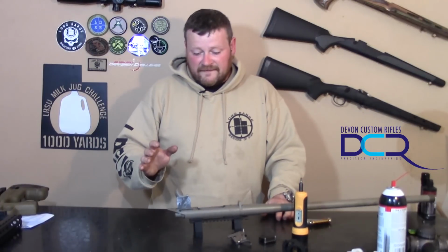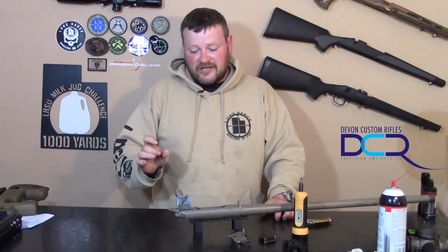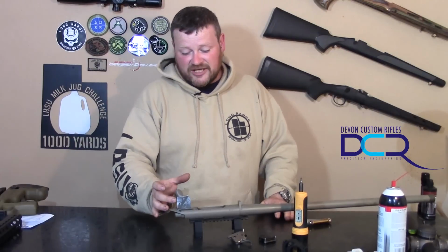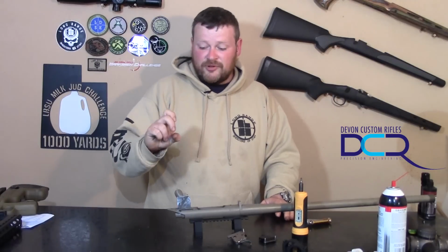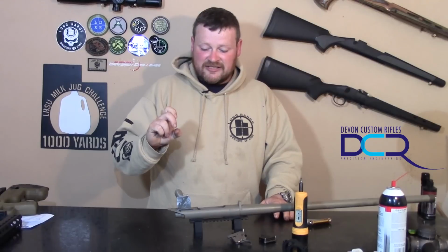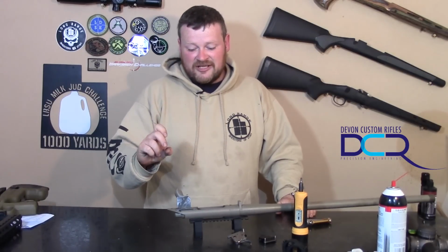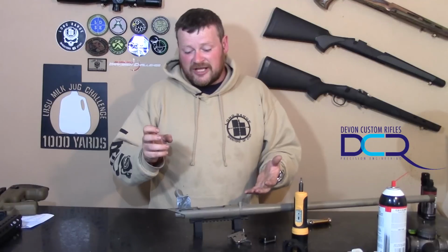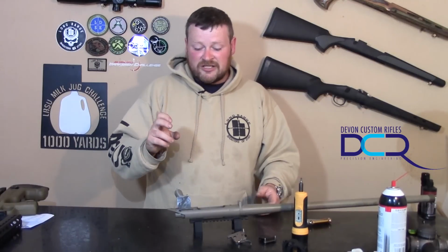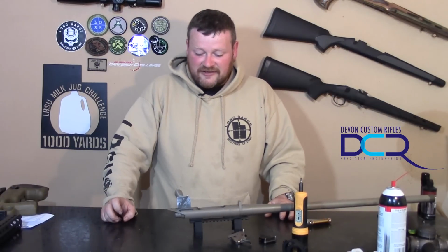Other than that, even the reset spring, I've never seen this before. The reset spring inside here has a little copper bushing on it, so that the stainless steel won't wear down the steel spring, because it is harder than it. The little bushing, I guess it stops rattling, but it also helps giving a complete contact all the time, and it's not going to wear out the spring in any way. It helps the spring. It's little details like that that makes this a very nice trigger indeed.